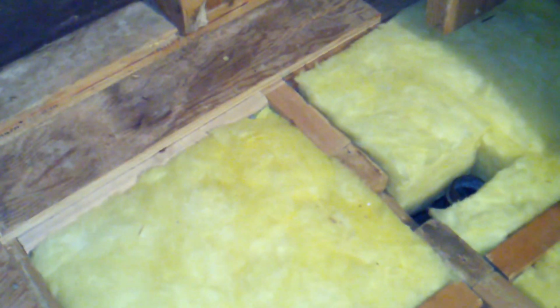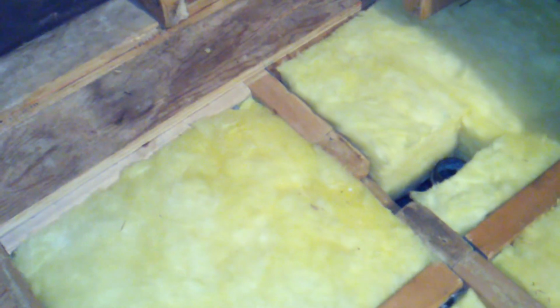And then of course I had to get to the subfloor next. For the subfloor, I wanted to make sure I made square cuts. I didn't want any uneven cuts, so it would make my replacement plywood drop into place fairly easily. So I took this outside wall here, it's an exterior wall, and I figured that wall is probably pretty straight.